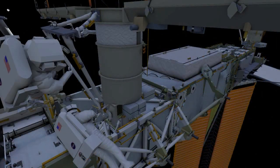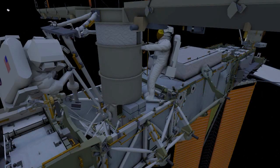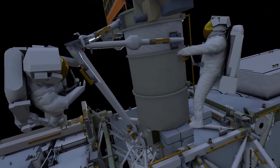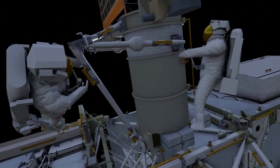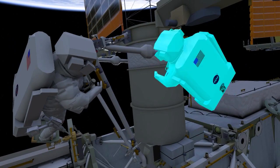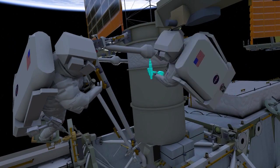Mark will reposition back on the BGA. They'll hand off the mid strut, and again, similar strategy for install. Once complete, Mark will translate onto the strut and drive the collar bolts. This will lock out the telescoping mechanism and rigidize the kit.